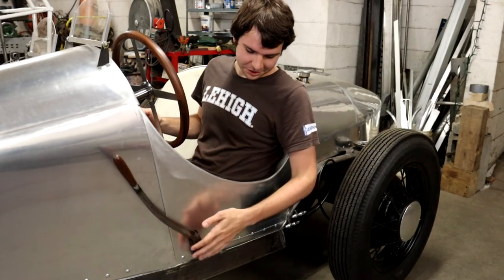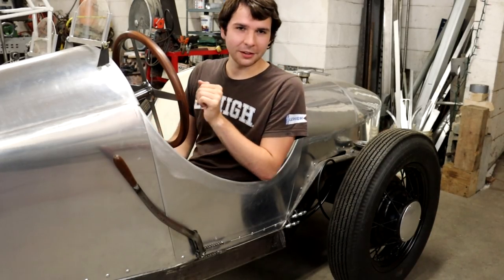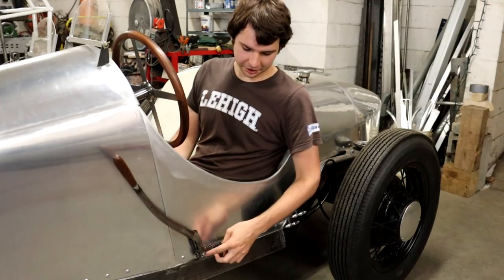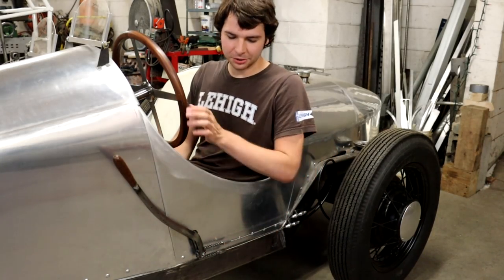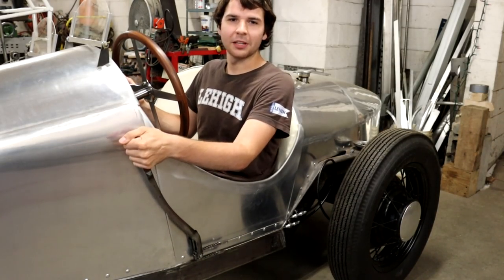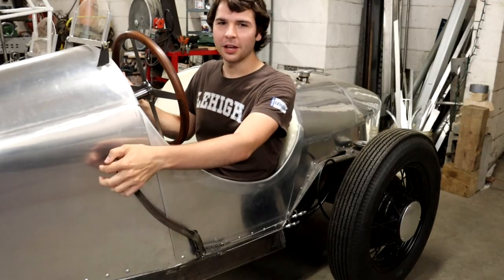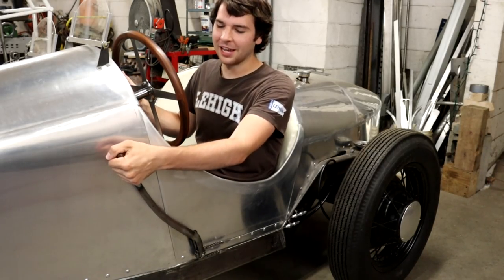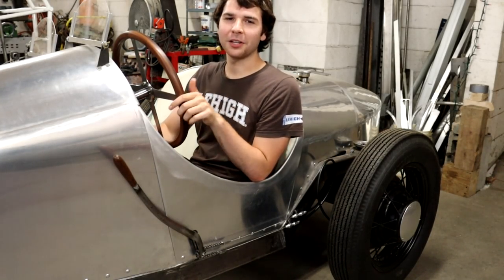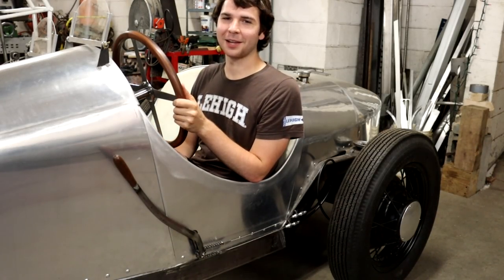There is the finished emergency brake setup, and honestly it really looks a lot like how I had it envisioned from the start. I really love the look of the external mechanical components — you can see the chain going around the little sprocket and the cables that go back to the frame. I think it turned out really nicely. You can pull on it and it certainly locks up the brake shoes inside the drums. Those still have to be adjusted though so I wouldn't trust them to stop the car just yet, but everything is moving the way it should. Let me know in the comments what you thought of the design, how you'd do it differently, or what your favorite parts were. That's all for today — see you next time.